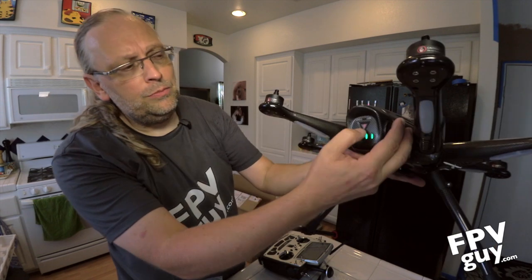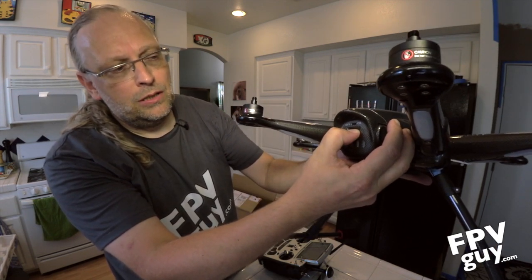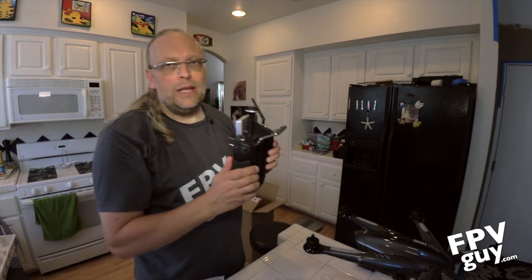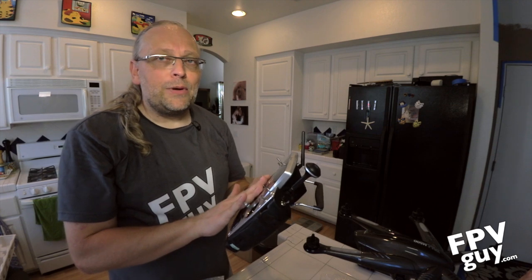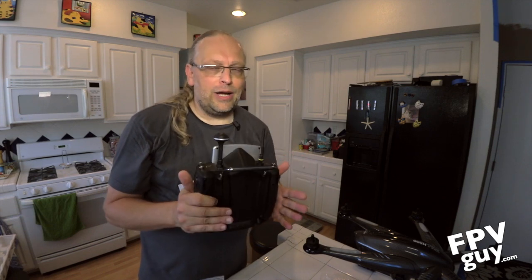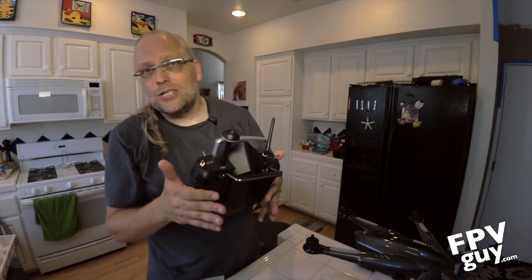Now, to save these settings, we're going to grab this and push it. Did you hear the radio? We just turned off this and now you can hear the radio vibrating — so that's telling me there's a problem. By the way, if you fly a full battery — so if you fly for about 20-some minutes — this is going to start vibrating on battery low. That gives you about a two-minute warning. So when this starts vibrating while you're flying, you should be getting yourself landed on the ground pretty much as fast as possible.